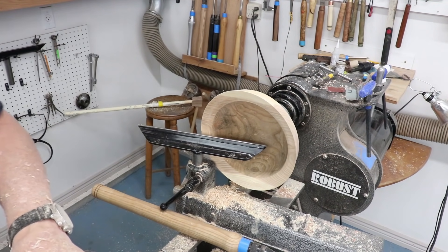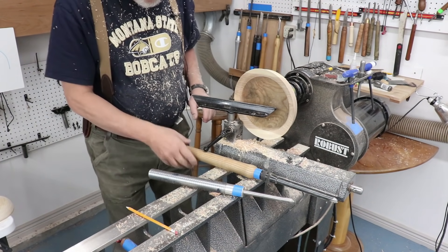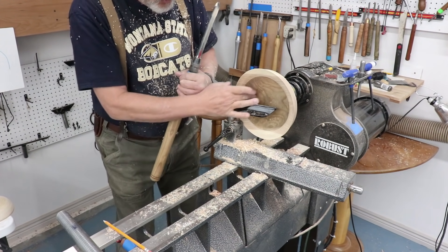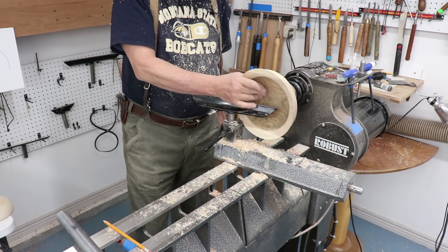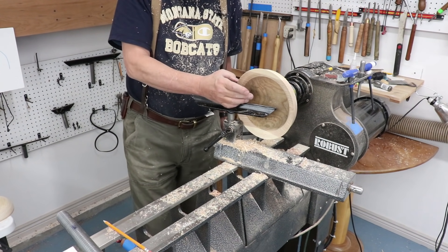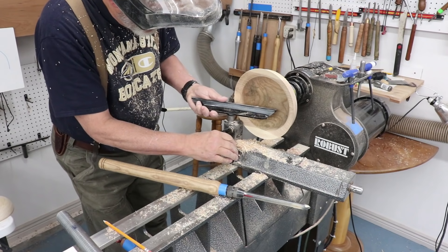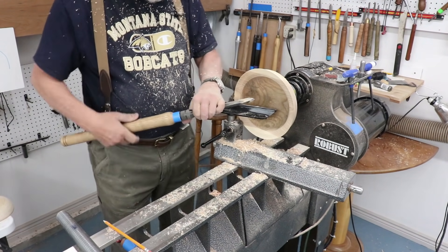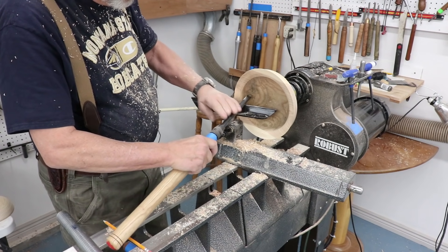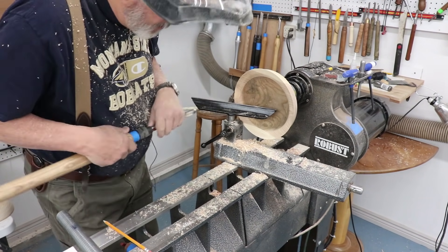I'm going to take my tail center and put it on the floor. I've got my camera backed off so you can see my tool and what position I'm holding it as I present the cutting edge to the bowl. I'm still fairly thick — probably approaching an inch all the way down through there. The first thing I need to do is true that up. As we look at scraping versus cutting — I'm going to try to cut this because scraping it is a little bit difficult and sketchy in terms of safety. You get out here scraping like this and you can get a bad catch. For me, I'm better off cutting.